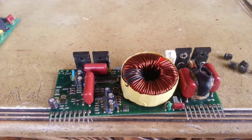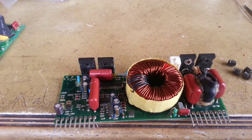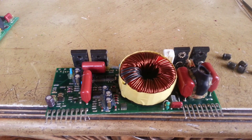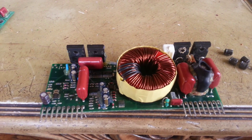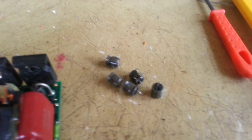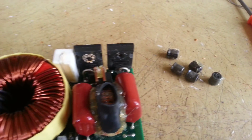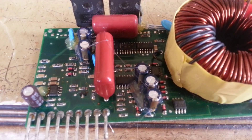In this video I'd like to tell you how to fix your Velodyne subwoofer, which goes bad after a while even though you didn't use it. What happens is some capacitors dry up and lose their capacity. They are 33 microfarad capacitors — as you can see, there are five of them — and you have to change them, replacing the bad ones with good ones.